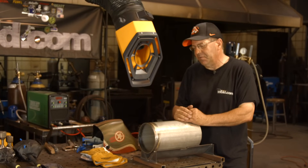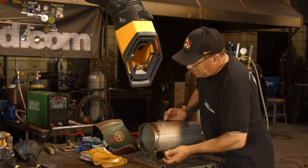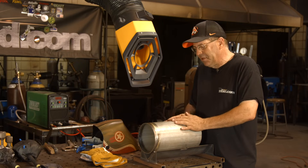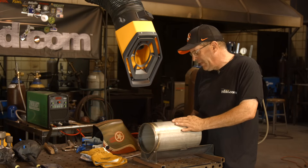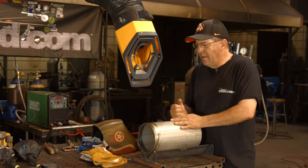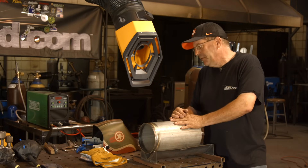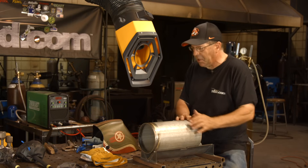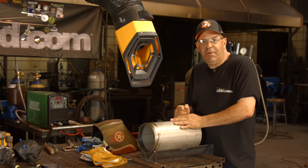In position, in the past I've always kind of had that bottom opened up enough where I had the fit where I could get the wire through on the bottom and use it as a heat sink. You know this thing's going to crawl up on you and shrink at the top, so I always had my top a little bit wider than the bottom. It's different when we're filming for the camera — we've got to stay kind of up in the top third so the camera can get on it. So again, Schedule 10 stainless — had a good purge going, put the root in with a 3/32nd 308L, let it cool off, then put the cap in with 1/16th 308L. Big shout out to Huntington Fusion on their Purge Elite — that's a fine product, it's quick, very fine product. That's going to help us out a bunch here at the college for training on stainless tubes. Appreciate you watching — please subscribe. Bob Moffitt with Weld.com, thank you.